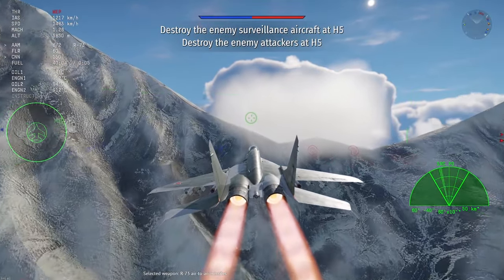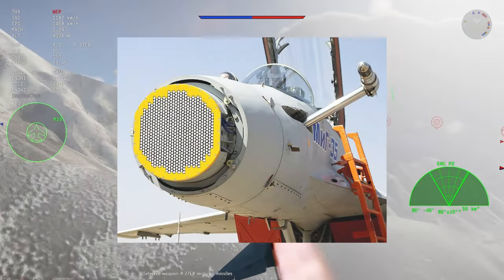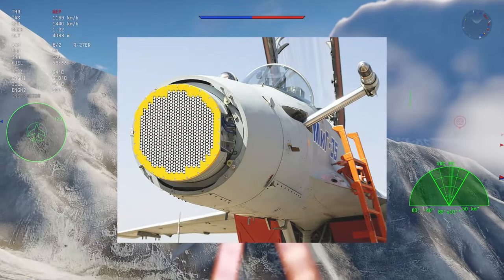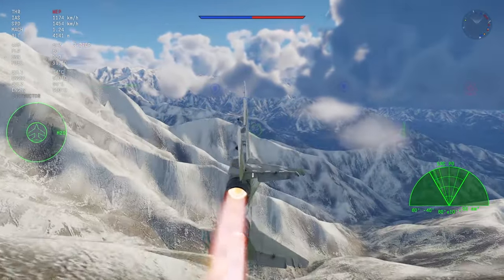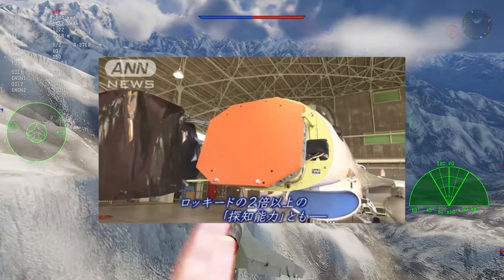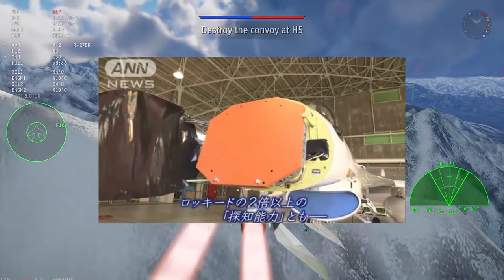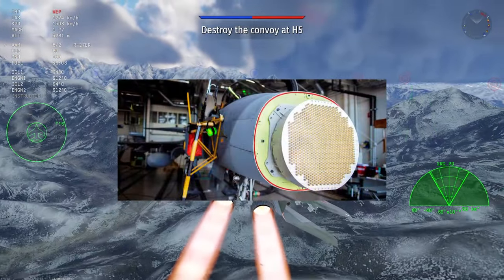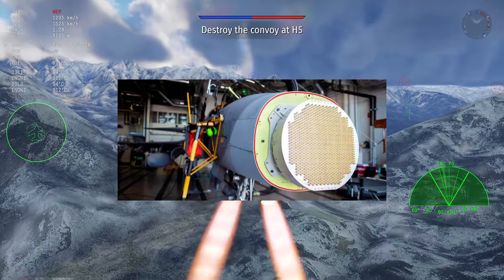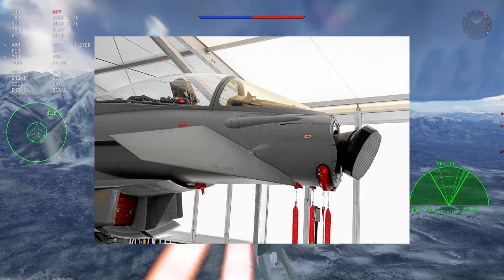Russia also made an AESA variant of the Zhuk radar on the MiG-29, the Zhuk AE, but that was only ever offered for export. Other AESA radars from other nations include the JAPG-1 on the Mitsubishi F-2 and the subsequent JAPG-2, Thales RBE-2 on the Dassault Rafale, the PS-05 Mark V radar on the Gripen, and the Euroradar CAPTOR on the Eurofighter.